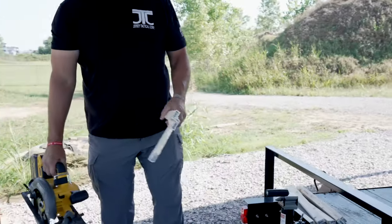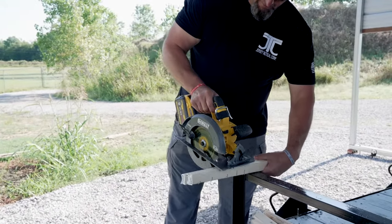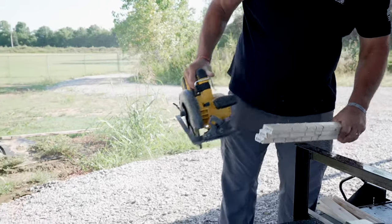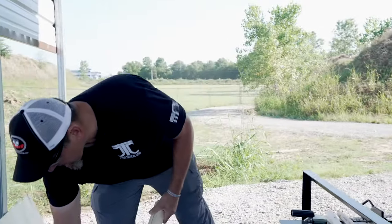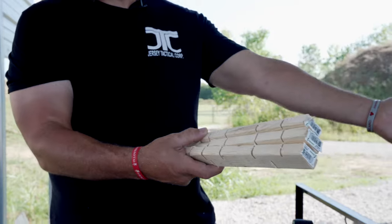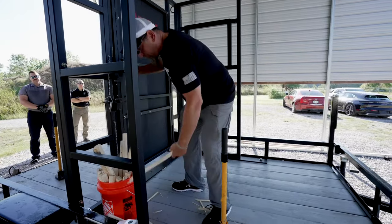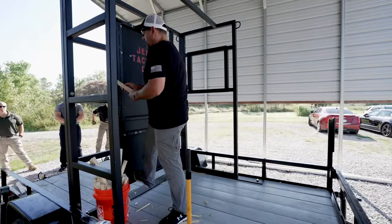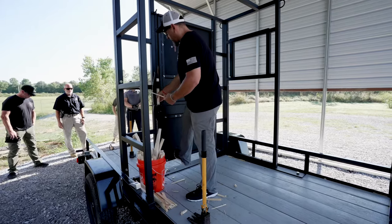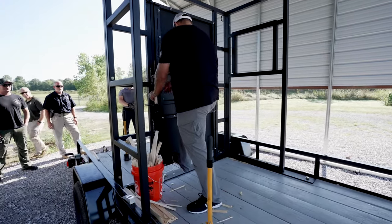We're going to go ahead and do some quick score marks like that, rotate it over. We made some easy pieces — nice and easy. That could be from the lower shims or lath all the way up to the full pieces, so we've got that whole progression. We're going to rig it so it's your general office door — three pieces of shim in there, a fairly decent door, nothing crazy, but it'll take some energy to go ahead and pop it open.